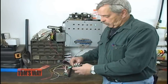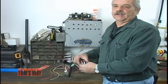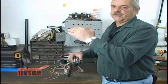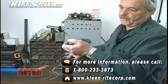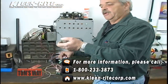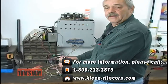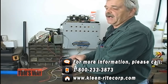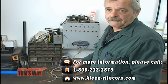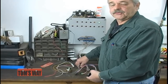The one thing is when you put the switch in, you're going to have the pointer pointing on stop. The next position over is pre-soak. The next position on your rotor is going to be pre-soak. So if you follow your rotary switch and your decal clockwise all the way around, you're going to go in the back and do clockwise all the way around on the back of the switch. So if you put clockwise on the front, clockwise on the back, your switch is going to be wired correctly. Then make sure they follow the same color code all the way back to the terminal strip.